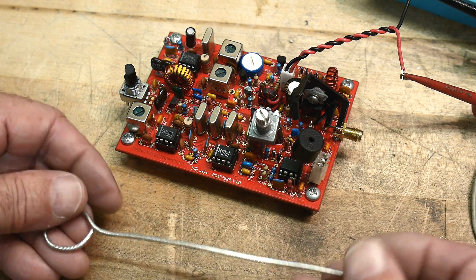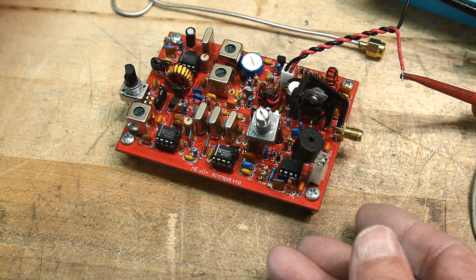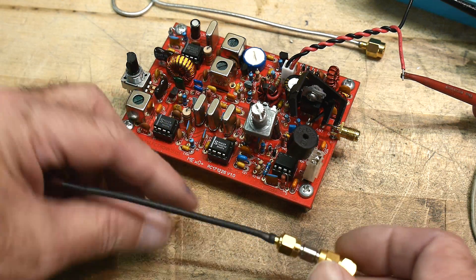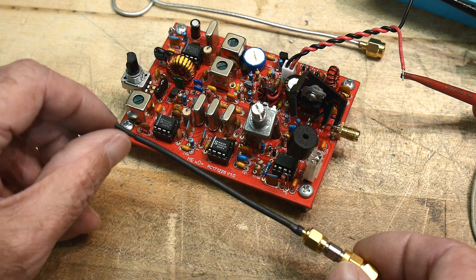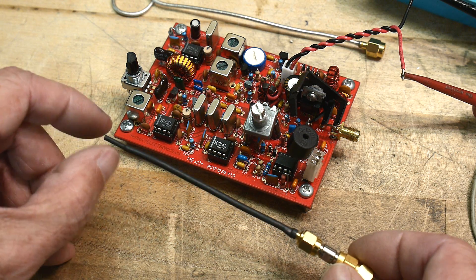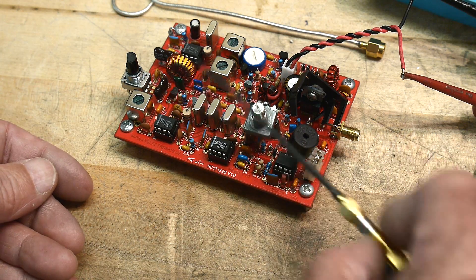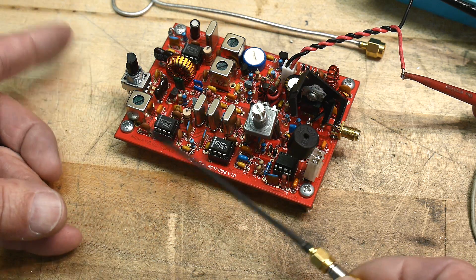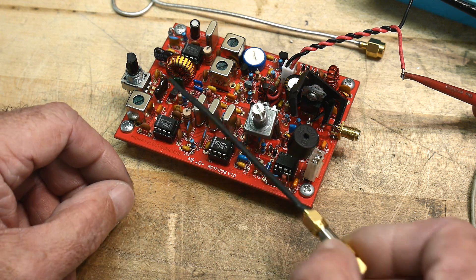The other probe that I made — if you watch my probe video, go search for it — is just a little piece of coax with a little quarter-inch antenna at the top. Stripped away is a little stub of center conductor that's about a quarter inch long. I put a piece of heat shrink tubing around this one so I can poke around and it's not going to short anything out. Nice thing about this is it's not very sensitive, so you have to get really really close to the tip — otherwise you're not going to see anything. So it's really good at pinpointing things.